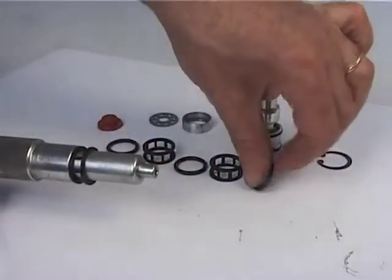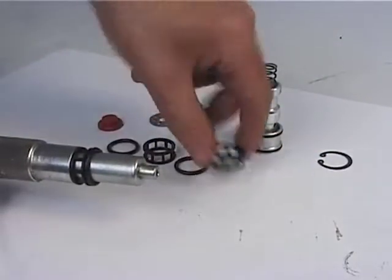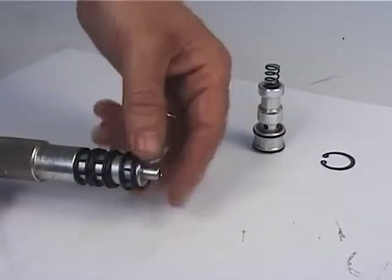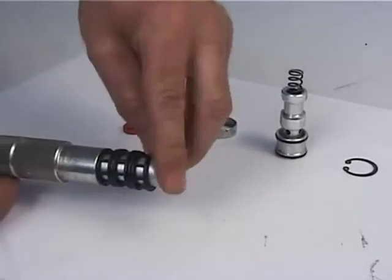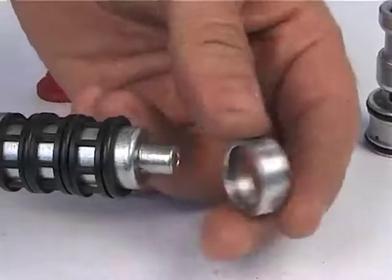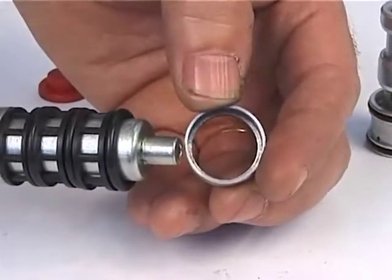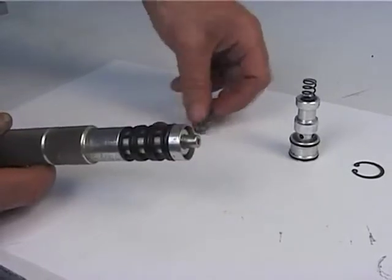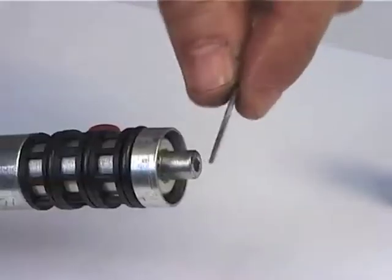When mounting the valve assembly, use a special wrench supplied on request and proceed as follows. Insert the casing, figure 54, and the O-ring, figure 55, in alternate positions. The spacer, figure 53, from the side with the highest surface, and finally the washer, figure 52.